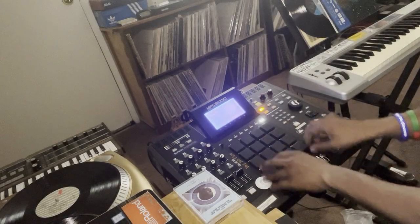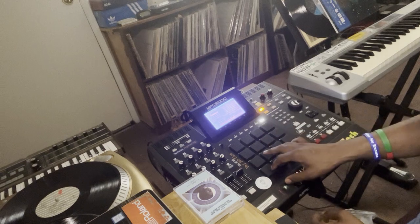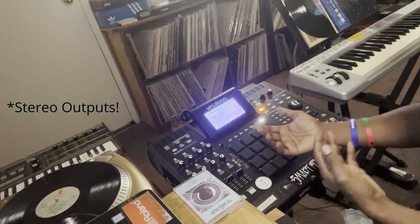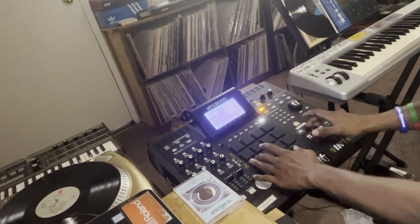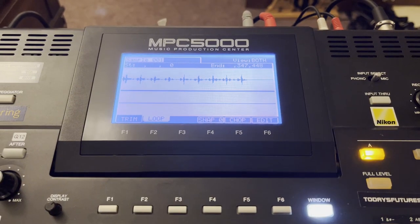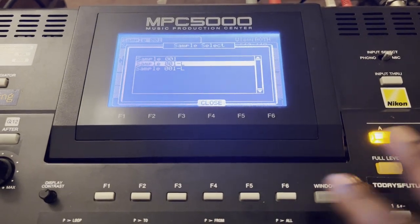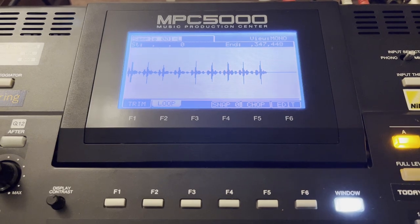Okay, so I put that shaker sample on program one — I haven't named it or anything — and then put it on pad one so we can hear it. It's all on just one of the stereo inputs, just because we only had one input into the XLR mic input in the back. So what I'm going to do just for sanity's sake, so we can kind of hear it better, is I went to the trim menu and I'm going to go to Edit and then go to Stereo to Mono. I'm just going to bring what's in the left input on the stereo and just make it mono, so whatever is in that left input will just be the straight signal — just one signal.